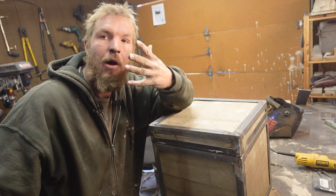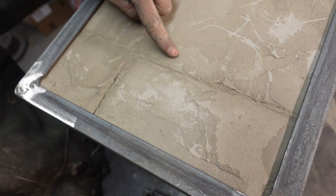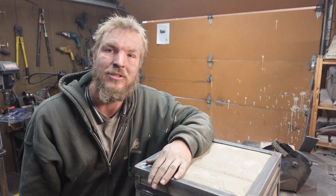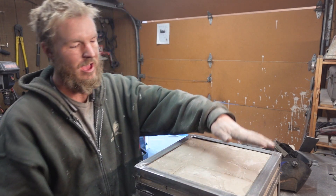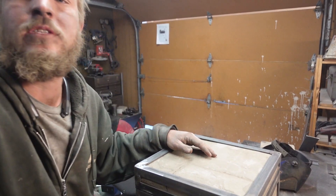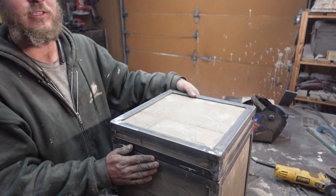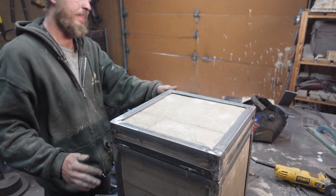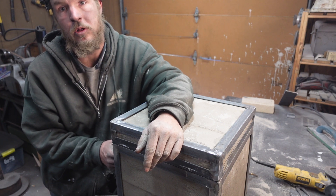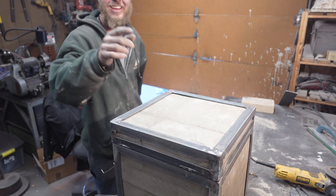You might be able to tell by how haggard I'm looking that I've had a heck of a time. Since the last shot the top broke — you see those cracks? For the past three hours I took this thing apart, remortared it, let it dry, and put it all back together. I scrapped that sheet metal on the side — it's just got angle iron on the corners now, and I think that looks a whole lot cooler, so silver linings. We're back on track and can get our hinges welded on. In the CAD model I didn't add those ceramic terminal blocks, and with those in place I can't have the cantilever top, so we're going with hinges instead.